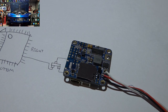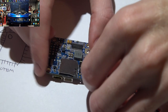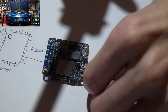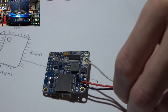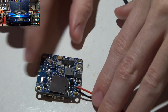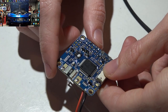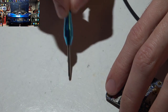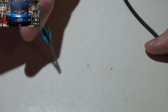Also tip: remove the wire from the pad first, because not all multimeters will have enough power to work through it — just take my word for it, remove the wires first. Now I could do that continuity probing method, or option two — and this isn't cheating but since I have this YouTube channel and have done this so many times — I know that the flip32 Omnibus flight controllers have had a design flaw with their LED circuitry.